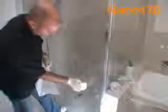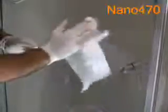Okay, now once we've cured that, what we'd like to do is maintain our clean surface, just remove that excess adhesive around the outside. Now you'll find that some has gone hard here. We'll fix that up later. That's a good indication that we possibly cured it a little bit too long. So if it's doing that at 30 seconds, maybe you need to drop that back to 20 seconds. But we really want to know when the bevel is cured to the glass itself.